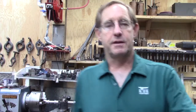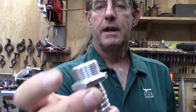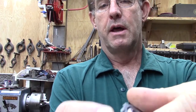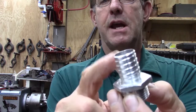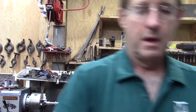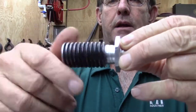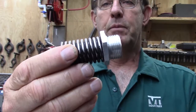And when I come back, then I'll show you what I got on the lathe and how I've got it set up. So this is the part that I'm making, and this end of it takes the standard nuts for conduit. So I can just use that and it works perfectly. But I had to change this diameter and thread this to match the conduit that I have. So now I can take this and I can screw it right in to that tight. And so that works perfectly.